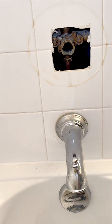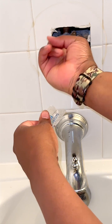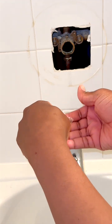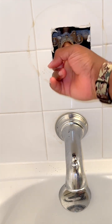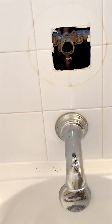If your cartridge is stuck, you need to call a professional plumber with a special tool to remove that. Most of them won't be though, so don't worry — you can simply remove it with vice grips. When you buy the cartridge, it should come with lube so that you can lube up where you're going to put the cartridge. You don't want friction; you want your cartridge to be smoothly inserted into the pipe area.